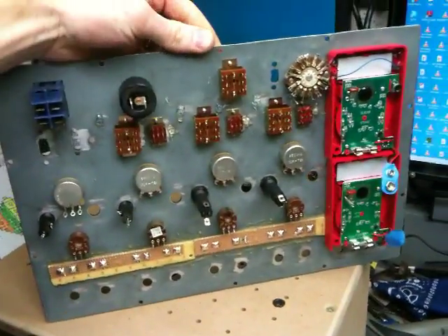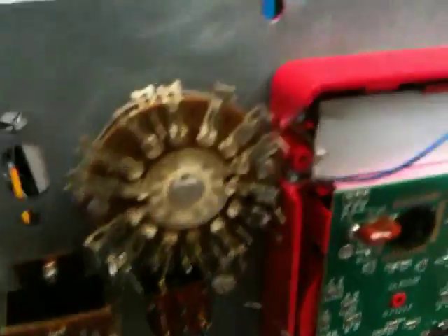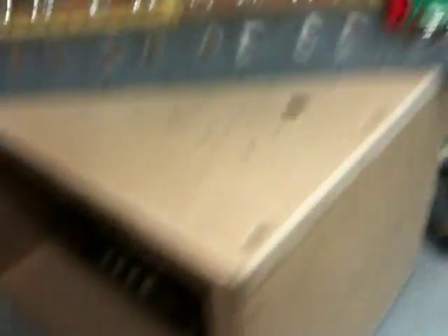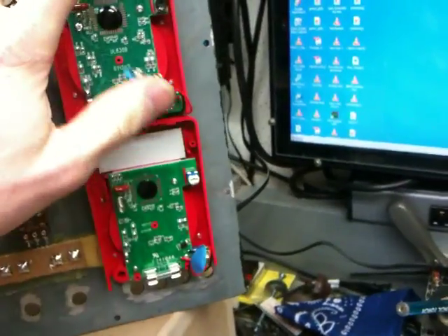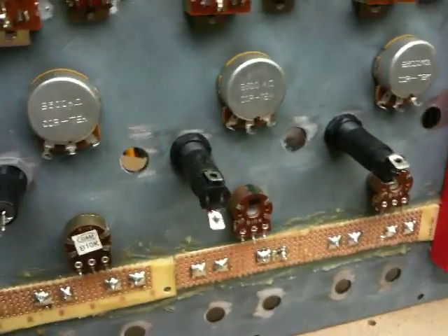There's the back. There are contacts on the top side here — I'm going to hook up these LEDs, you can see them up there on the top. These LEDs need 9 volts, so I'm going to get a 9-volt power source. The power supplies in this box don't have a 9-volt output, so I was going to put a regulator on one, but I might find something else. Got all my potentiometers here and all that good stuff.